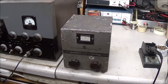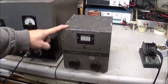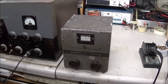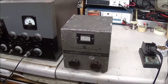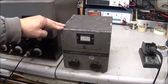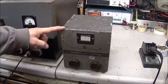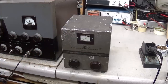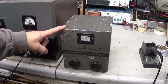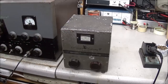You still need to go in and change that resistor out to a good quality 18k 5-watt resistor. When we rebuild this we'll go ahead and do that, and put some new cabling on it — I noticed some of the cable on the back is not in great shape. I'm considering scanning the face plate and printing a reproduction decal, buying the $70 reproduction plate, or just leaving it as is.